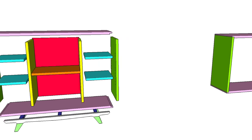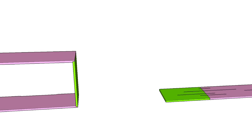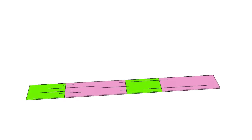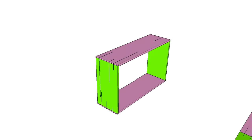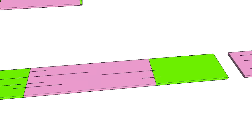I'm going to start off by making the outside of the case. In an ideal world, I could unfold the bookcase and make one giant panel and cut it into four pieces so that the grain would be perfectly wrapped around the bookcase. Unfortunately, that would require about 120-inch-long boards and I wasn't able to find any that long, so I'm going to make one long panel and a smaller one for the bottom since that won't be quite as noticeable.